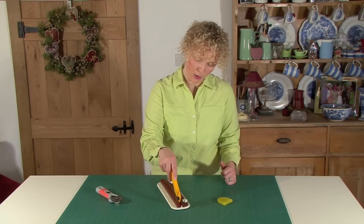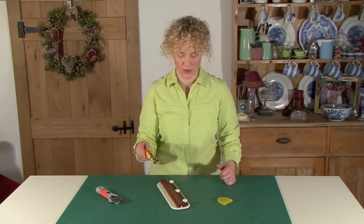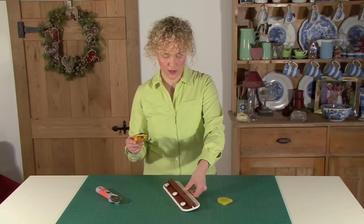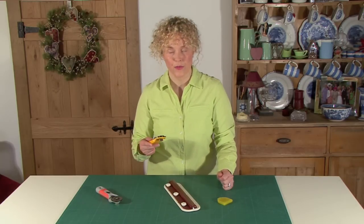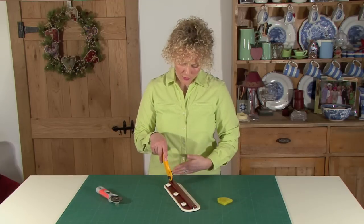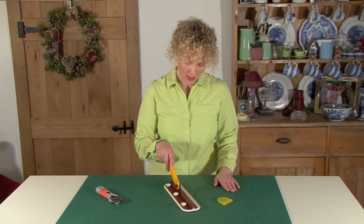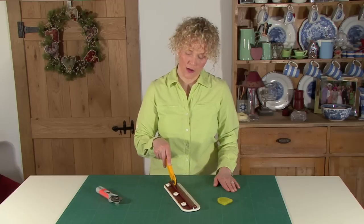That's nice and simple — I'm not putting any pressure on at all. When you've done it 20 times, rotate the whole tool 180 degrees, because the stone is only going along one side, so you want to sharpen the other side of the blade now. Slot it in at a 45-degree angle, make sure the blade is upright, and again 20 times up and down.